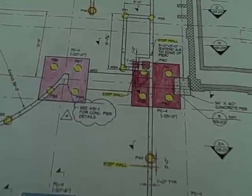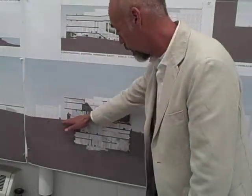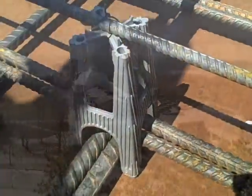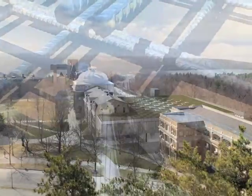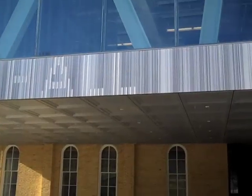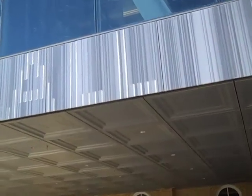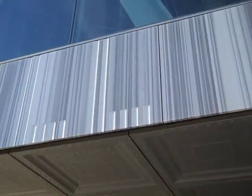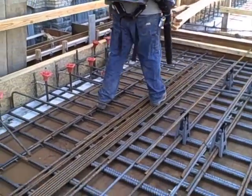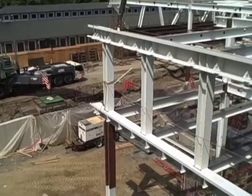After it is designed, but before it can be occupied, a building must be constructed. This is the story of the construction of Milstein Hall at Cornell University. The stone veneer fascia and aluminum soffit are part of the building enclosure system of Milstein Hall. Other elements of this system are discussed elsewhere in this video series. Aside from the reinforced concrete dome, foundation walls, and ground-level slabs, these enclosure elements are supported by the steel structural frame.